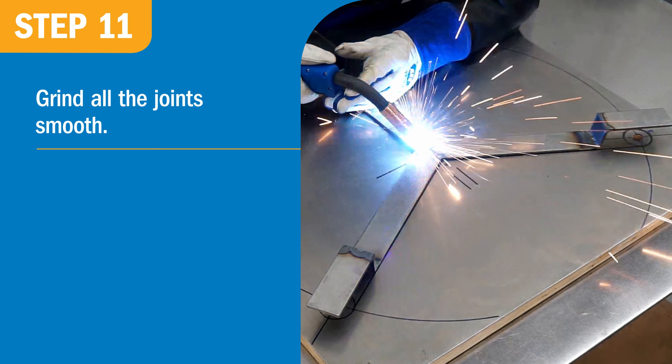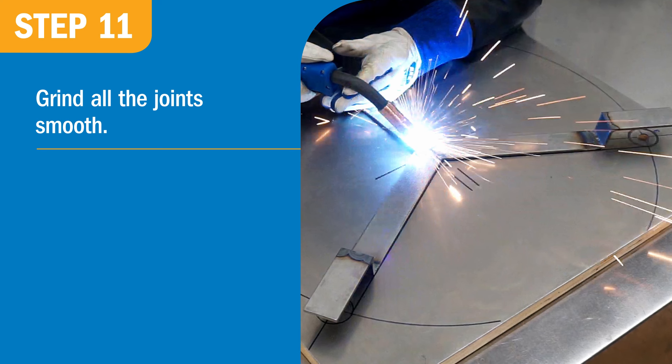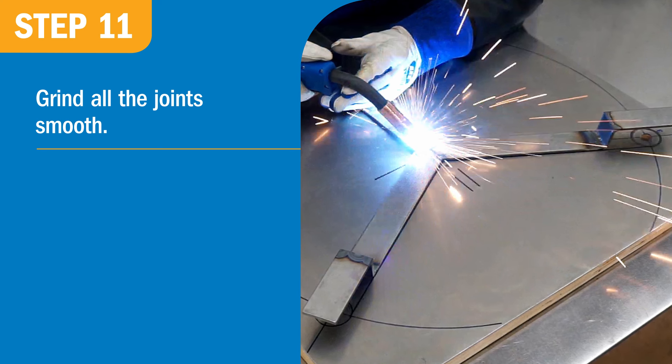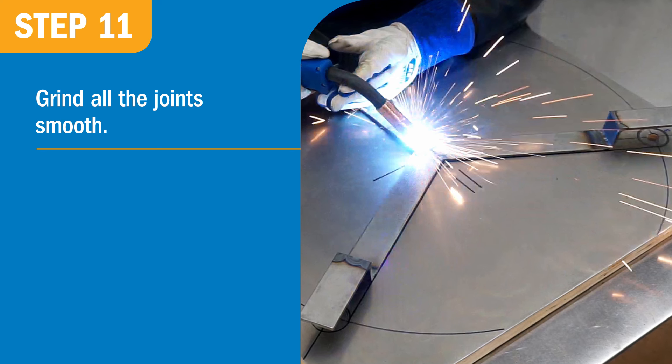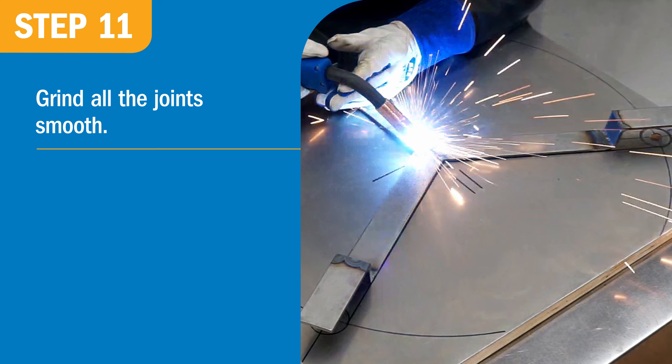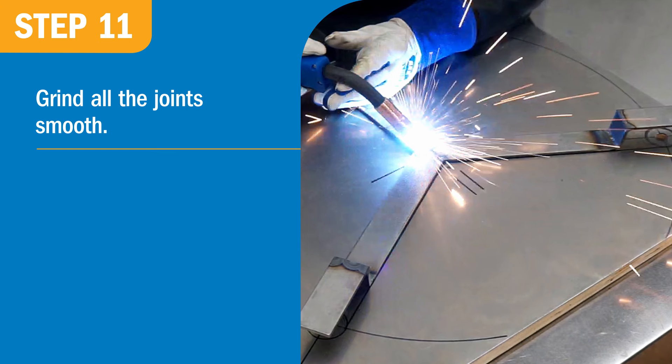You may need a bracket to hold the tray to the caster tubes, which you can make from a 1/8-inch by 1.5-inch bar. Weld three pieces of material together for each of the Z-shaped pieces. Next, using the fixture, properly align each piece, then cut and weld them at the center and grind the joints smooth.